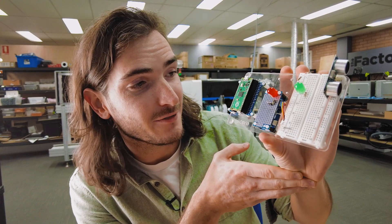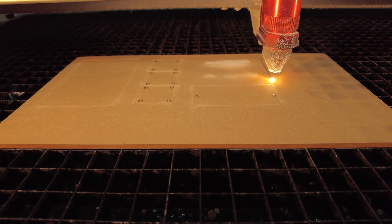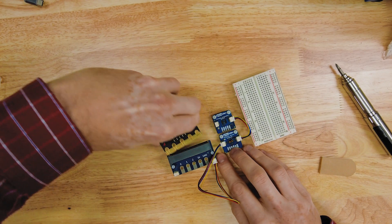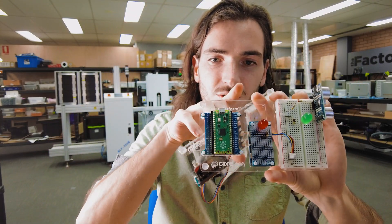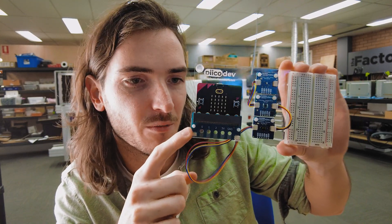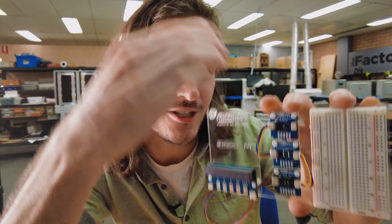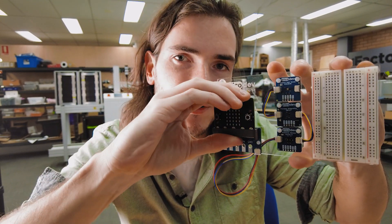You've seen the pkdev platform for Raspberry Pi Pico. I also spun one up for micro:bit. Now you can have a micro:bit project on the bench, lock it down with your sensors and prototyping circuit, put it away, get it back out, and everything is still connected and stable. It looks pretty similar to the platform for Pico — all I really had to do was remove the Pico expansion footprint and add the pkdev adapter footprint for micro:bit on the left side of the board. The adapter is held on by two standoffs, and while I had concerns it would be flimsy, you can actually engage and disengage the micro:bit quite happily, just cantilevering off those two standoffs. No worries.